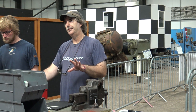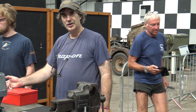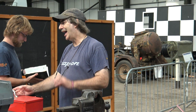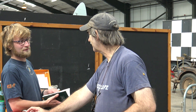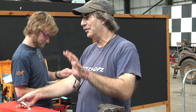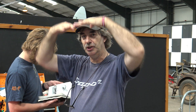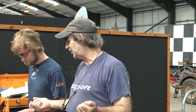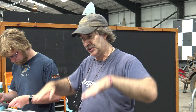It's just fiddly, isn't it? When you put the block on, do you have all the pistons at the same height? There are two methods: the Rolls-Royce method and the Packard method — or rather the Rolls-Royce method and the wrong method. We've decided the Packard method is the wrong method. The Packard method sets four pistons together at the same height so you can get four on at once, but it makes the oil rings on the outer cylinders much more difficult. With the Rolls method, you do two at a time — two pistons, two pistons, and the last two. We've just found that easier.